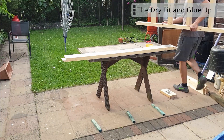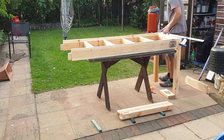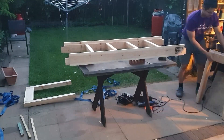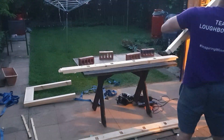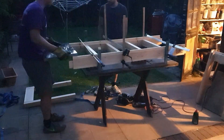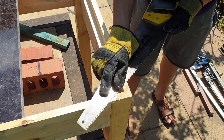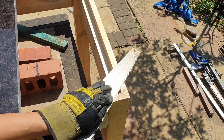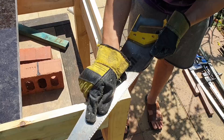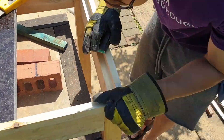Although this looks like it went together really well, there were some minor issues — I did actually have to get it back on the CNC and take off a little more material in certain areas. The glue-up I did quite late in the evening so the camera footage is bad, and the glue-up was just so rushed — I just needed to get the pieces in place before the glue dried. I'm using some slow-cure 24-hour Evo-Stik; it works quite well and didn't get much glue seepage, so I'm happy with that. Before you comment below about a tenon saw — I do have one now, mainly because this took ages with a blunt, very inappropriate tool. I'm very happy I left some material on the leg pieces because it allowed me to get them quite flush with the supporting sides.